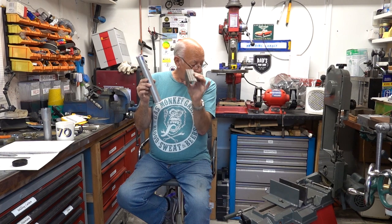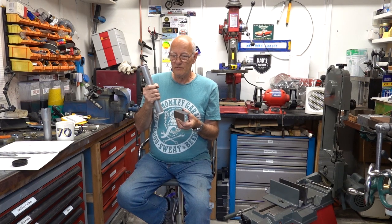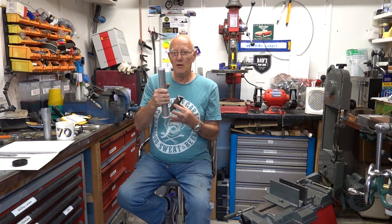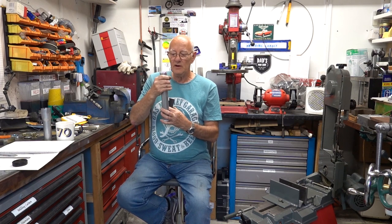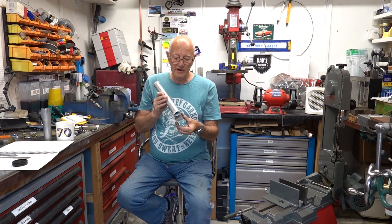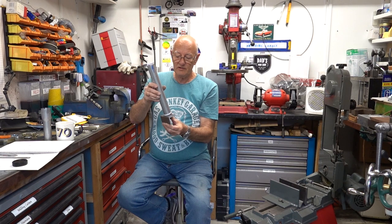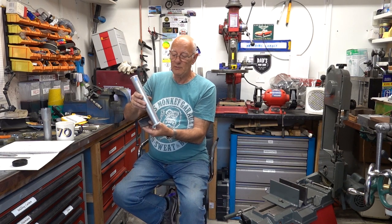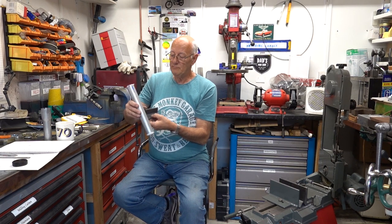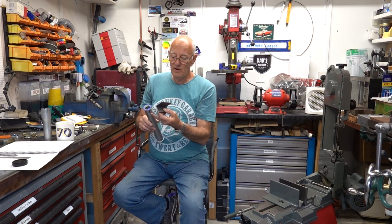One of these pieces of angle iron, I've yet to cut another one, because this isn't that strong. I'm not confident that with the wind, eventually it might fracture. So I'm going to bore a hole in here to accept this. So this will live in a pocket there and one up near the top. And then I'm going to TIG weld them all the way around.